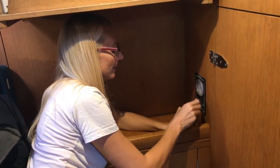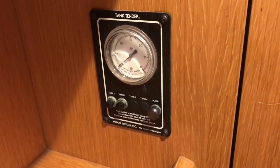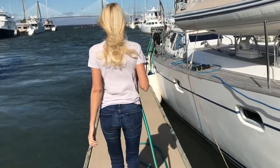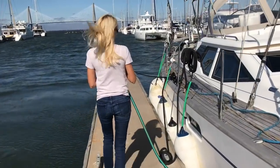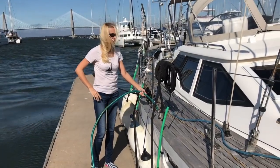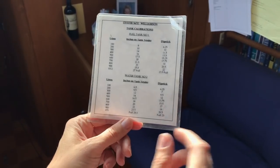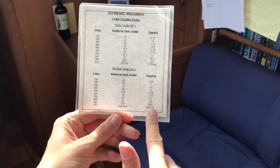Check your fresh water level. Our fresh water system is pressurized by an accumulator tank — if we get too low, it throws our whole system out of whack and can take hours to get working correctly again. It's imperative that we never let our water tanks empty. Another reason to monitor water levels is the decision to ration: if you want to stay at an anchorage for a few more days but you're running out of water, reduce consumption or, if you have a water maker, make some water.